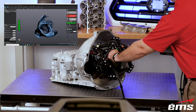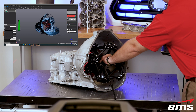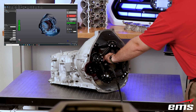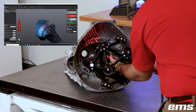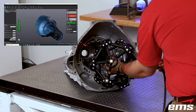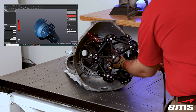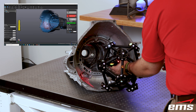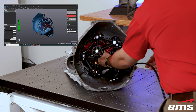If you'd like to see an in-depth demo of the MetraScan, check out the links to our demo videos in the description below. The MetraScan also uses an intelligent part tracking system called dynamic referencing, which allows the C-Track system and the part to actually be moving while you are 3D scanning, with no loss of part quality or accuracy. This is ideal for shop floor metrology and inspection, where movement and vibration can be a real challenge for other 3D scanning and probing systems.